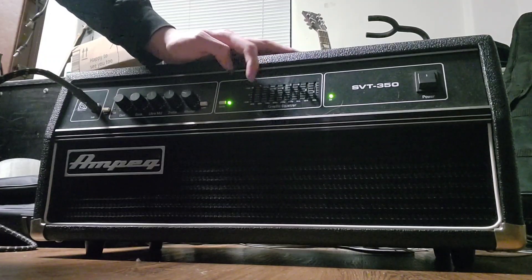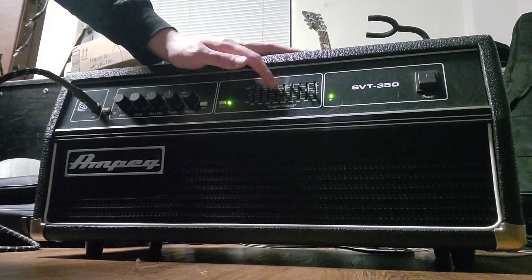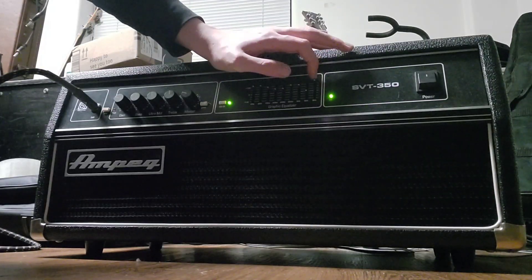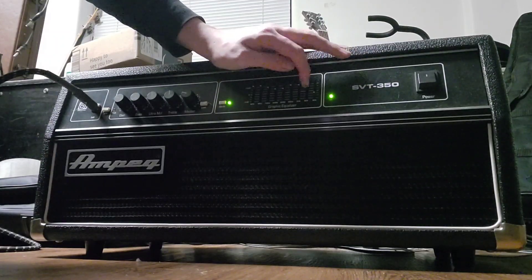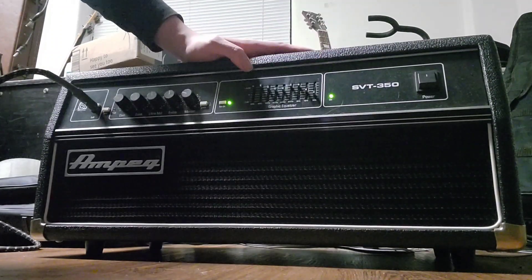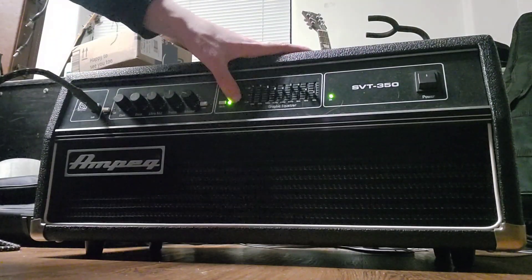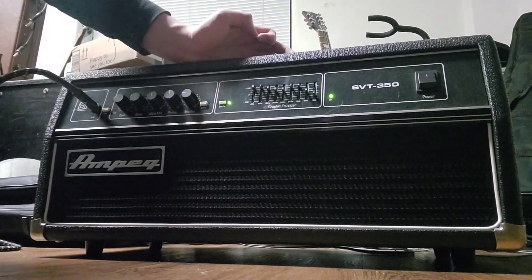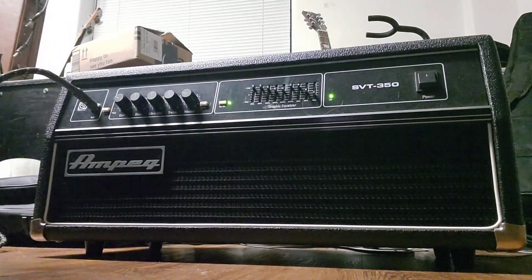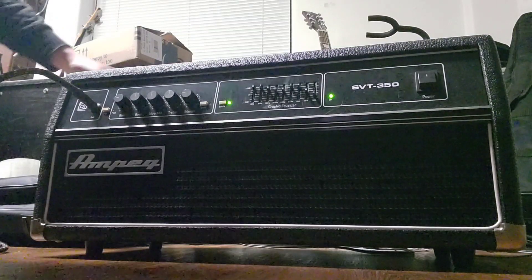Here we have the EQ — I don't remember why I set it like this. I typically like a mid scoop but it seems like I just boosted everything except for the frequencies you can't really hear. It's just a typical graphic equalizer, good for plus or minus 12 decibels. There's no EQ trim on this thing, which I don't really like — usually I like having an EQ trim so when you turn on the graphic equalizer you can cut or boost at will. But this is kind of a leave-on thing, which I'm okay with as well.